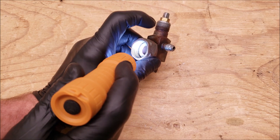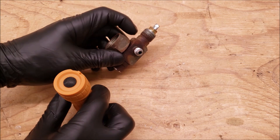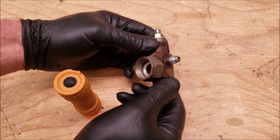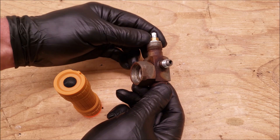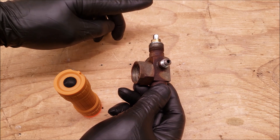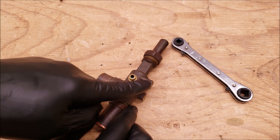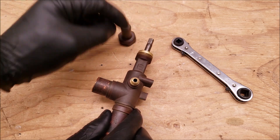You're going to have the receiver connected to the port. So if you need all three to be connected, you're going to have this in the mid-seat position. When it's all the way in the back seat position, it's going to act just like the standard three-position service valve, and it's going to shut off this access port. So during normal operation, it's going to be all the way back seated, counterclockwise all the way up.